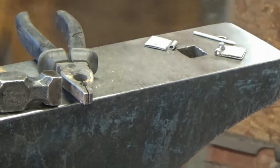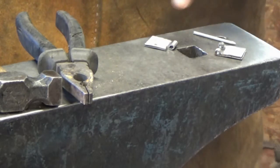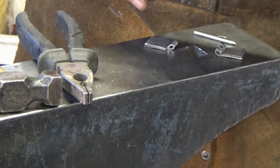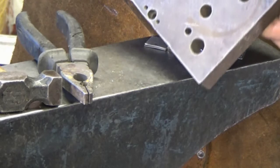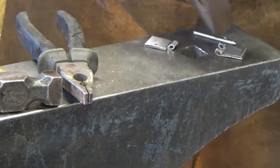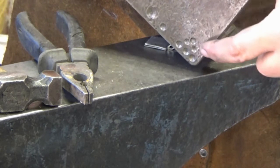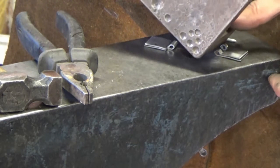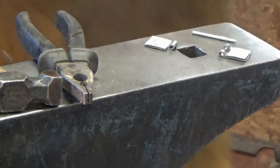It just makes for a better hinge and you stand less of a chance of bending this as you're putting it into the hinges. I found this old piece of metal for about £5 from a scrapyard and it came with a load of holes already drilled in it. And it's perfect. I've no idea what it did in its previous life. You can see at the end here, if I can get that in focus, these are just holes I've drilled with about a 5mm, 4mm drill. Just touch them in and use those for rivet sets periodically as well. But anyway, to the hinge.